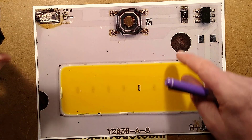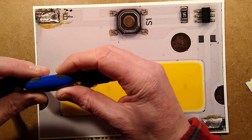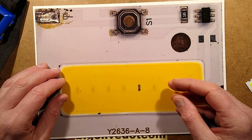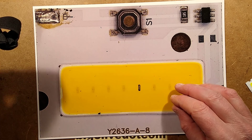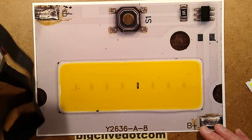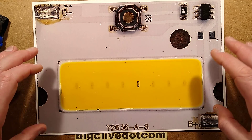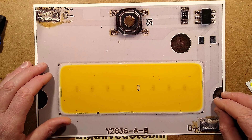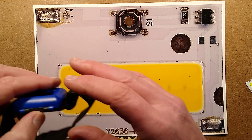Overall, it's a nice construction — so slim and lightweight. As an emergency backup flashlight it's not bad at all; it puts out plenty of light even with nickel-metal hydride cells at their lower voltage. I quite like this design. The COB LEDs are all mounted on one aluminium substrate, which improves heat sinking and integrates all the components onto one simple flat circuit board, enabling a very low-profile light. It's quite neat.